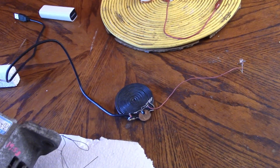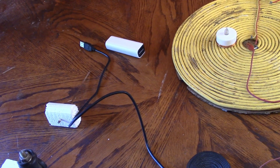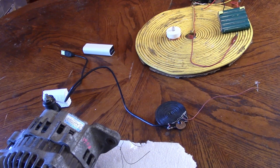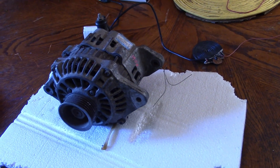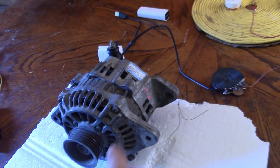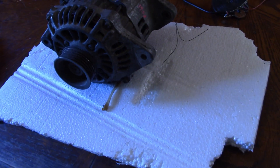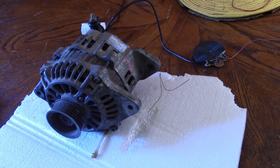Now the idea is to use this coil, which is obviously much smaller, but I'm also improving the battery situation by using a USB power bank. Another goal is to hopefully transmit further than 350 feet — I'm going to try and get to 500 feet. I'm also testing out something that Fausto suggested in a comment: about the ground being excited and it being different than people imagine with the power going over the wire. I'm going to ground it at the other end using a car alternator — a big mass of metal — insulated by foam.